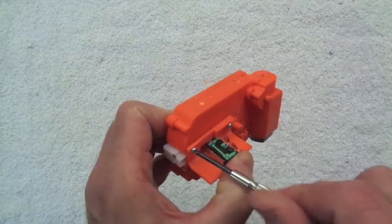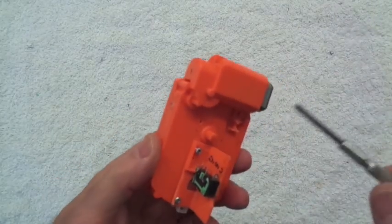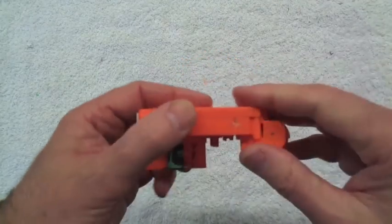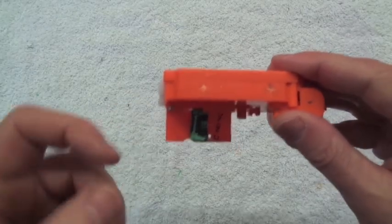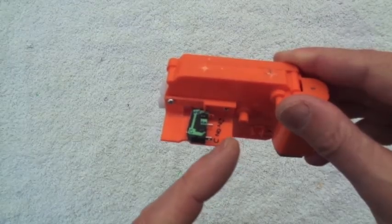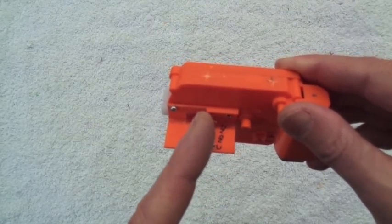You can see there's a dog in the back here which pushes on the lever as the pusher arm goes backwards and forwards. Fitting that right in — where that's sitting it's fully retracted. Screwing that in place using very short screws, since the front one's not so important but the back one is because it might hit the cog. When the pusher arm is fully retracted, that lever is pushed hard back up against the body of the switch.